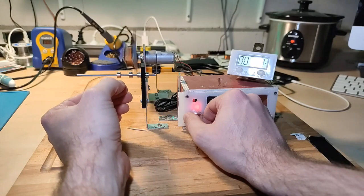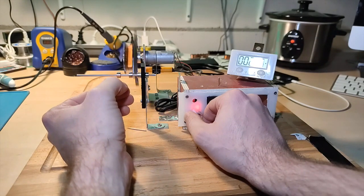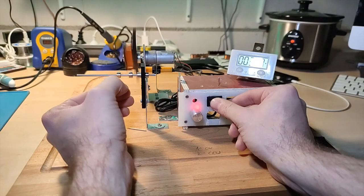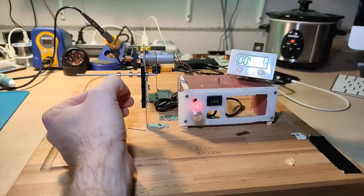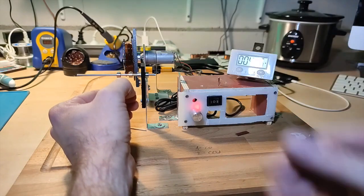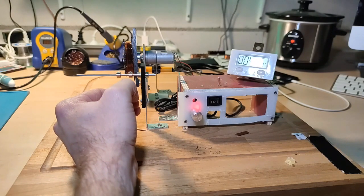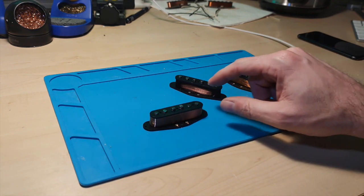As you can see I'm guiding the wire by hand. This is really the difference from a machine-wound pickup — when the wire is guided by hand you get a scatter-wound, chaotic pattern, in contrast to machine winding which goes from left to right in a strict pattern. With hand-wound pickups you don't have that. I have a couple of hundred turns and I check if the guides are set correctly. I won't show you the whole winding because it's rather boring and I don't want to show my winding patterns, as they make up the sound of the pickup. All three pickups are now wound to spec.